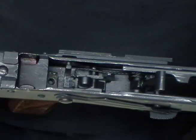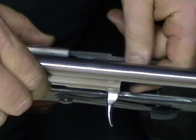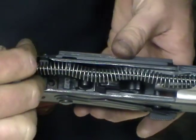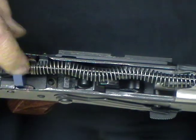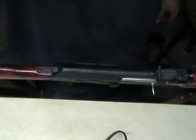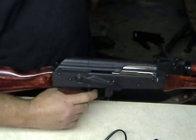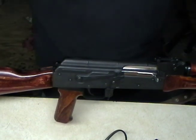Now your pins are not going to pop out on you. Once you're done with that, you pull your hammer back, drop your bolt back into it. If you're wondering what this little blue thing is right here, this is actually a recoil buffer. I've got a separate video on that if you want to — they're very simple to install, ten bucks, and it makes your rifle shoot a little easier. Go ahead and drop that thing on there. Then you want to function check the rifle to make sure that it does function like it's supposed to — cycle it through a couple of times, drop the hammer, cycle it, and make sure that your hammer pins and trigger pins stay in place. Well Andy, I hope that helps out. I hope that clears up any misunderstanding. Write me back, let me know what you think. Thank you for watching.